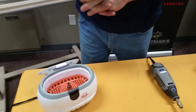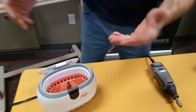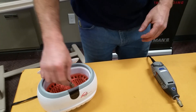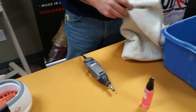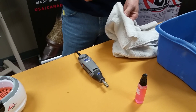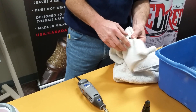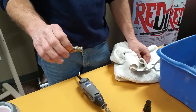This is a steel tool with the diamond electroplating. You leave it in there for about two minutes, and when you take it out — we're going to imagine that we've turned this machine on — you take it out, roll it in the terry towel, and again blow through the hole aggressively, wipe it off again, and you've got yourself a brand new tool.